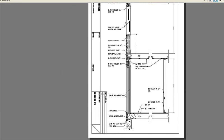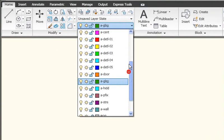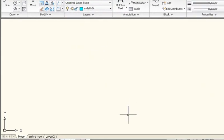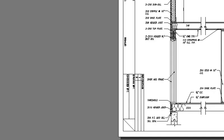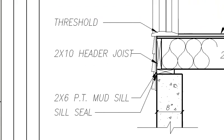I'm going to start in AutoCAD with a layer for Detail 4. That will be my thick line weight I'm using to define the outline of all of these things in section. When you're slicing through something, the boundaries of that object should be a thick line, and then a hatch on the inside of it — which is what we're seeing here. There's a hatch pattern, for example, as a concrete hatch. That should be a really light line weight, similar to section lining if you were to do this by hand.